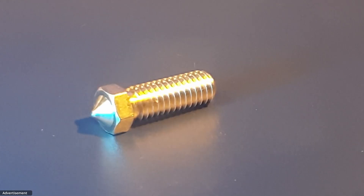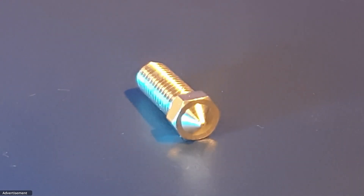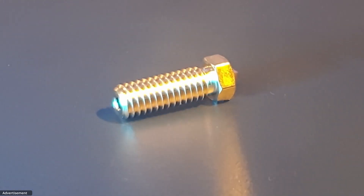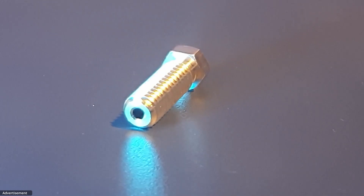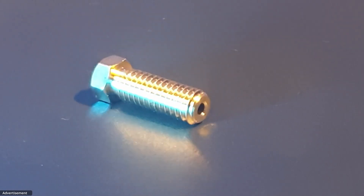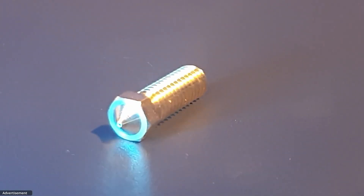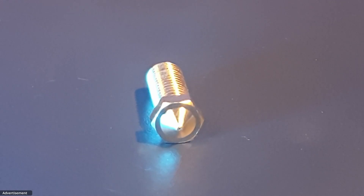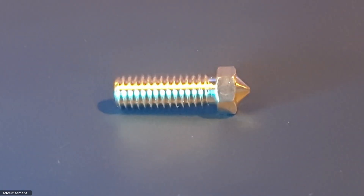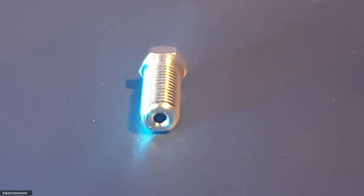Let's quickly come back to the nozzle subject again, like we started talking about at the beginning of this video. Really make sure what kind of PLA you will use to print. If you buy PLA with real stone or marble content in it, make very sure that you don't print with your standard brass nozzle — this filament is much too abrasive for it. You really need a steel nozzle or another hardened nozzle that can withstand this abrasive material, else your nozzle will be defective after some hundred grams, maybe half a roll of filament.